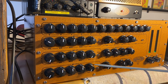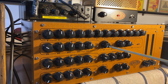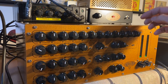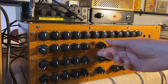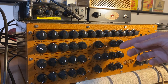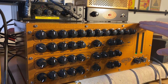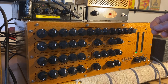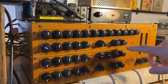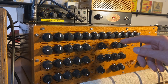This is channel one auxiliary, this is channel two auxiliary, this is channel three auxiliary. All three channels are the same but they work separately. If you want to put a deck in here, this is the volume for your deck and you would switch it to deck. At the moment I've got it coming in at line level from the phono stage, so I'm switching it to line level. That's the line input — you could have a CD, laptop, mobile phone, whatever you want at line level. The full graphic is operative on the music channel, which controls your gain for the deck or line input. And this is the amount of echo on that channel, which I call the music channel.